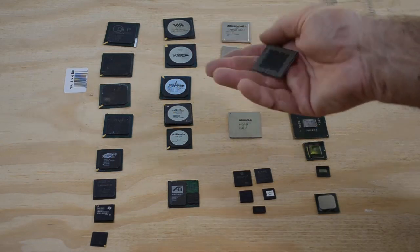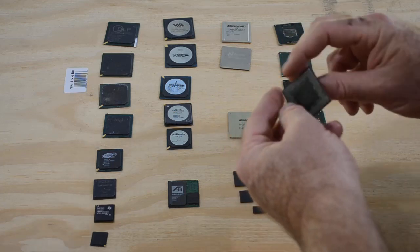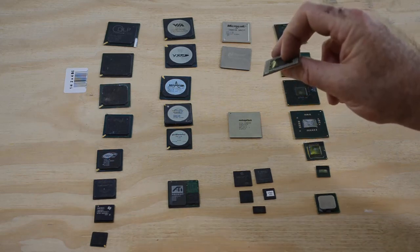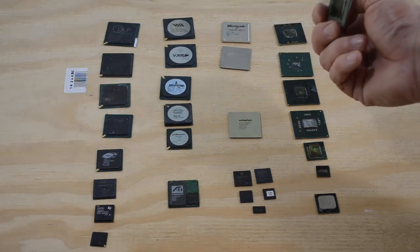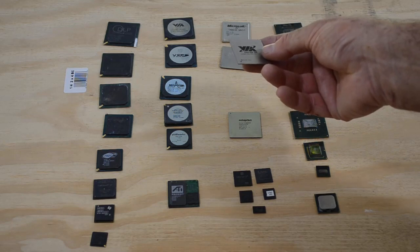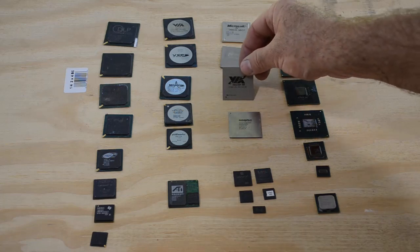But per chip it's not bad. What you need to do is get a really thin knife blade in there and peel the fiberglass backing and epoxy blob off of the plate, then process them like you would other BGA chips. I prefer incineration; I've done videos on wet ashing but I don't really recommend it. You could also just incinerate the whole thing and then pull the copper plates out of the ashes and take them to the recycler. But don't get your fire hot enough to actually melt the copper, because then the copper will alloy with the gold bond wires and you've got a trickier problem getting it back. You don't want that.